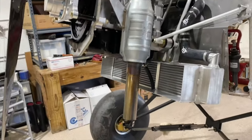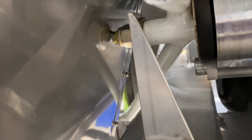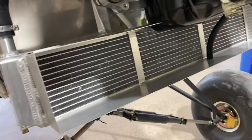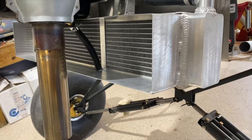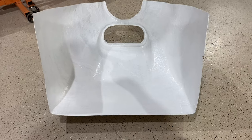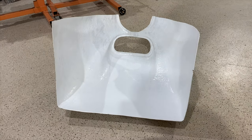The radiator system, you install that by hanging it to the bottom rear of the engine mount to the same bolts. And the radiator is the same width as the airplane. It has a box on it which collects some of the air, or all of the air, as much as you want or need. And then all of that is inside of the cowling for that nice streamlined look externally. So you can see when the cowling is on, the radiator would sit right here in the back, so you won't see it from the outside. Very efficient system and will pick up some speed for this kind of an airplane.